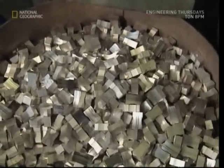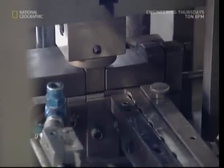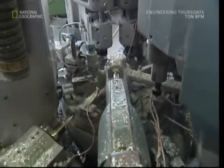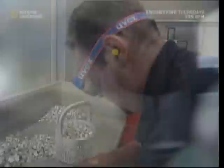The blocks are then loaded into the next machine, which is where the real work of making pencil sharpeners takes place. Anyone who was ever bored in maths or history will certainly recognize the shape that's beginning to emerge. As each blank passes around the machine, it creates the main hole for the pencil, the screw hole to attach the sharpener's blade, threads the hole so the screw will hold tight, carves the space where the blade will sit, and files it down to remove any sharp edges that may injure the user.